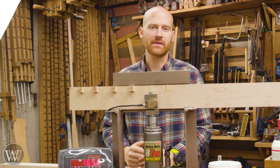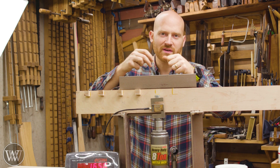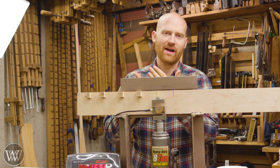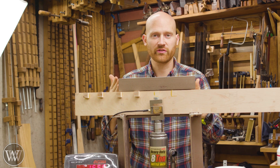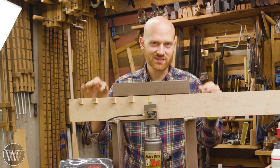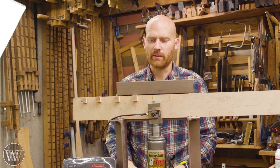A lot of people are going to ask about tensile strength. To be honest, most joints aren't in tensile — they're actually in shear. If you're in a mortise and tenon, a half lap, or anything like that, you're generally in a shear plane where most of the force is going. So this is a fairly good way to study that. Also, there really isn't a good way to do long grain to long grain tensile strength pulls because in most glues the wood breaks long before the glue does — there's no good way to pull them apart at the glue joint without breaking the wood around it. If someone has a great idea for that, please let me know.